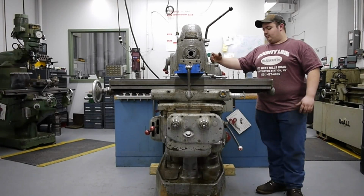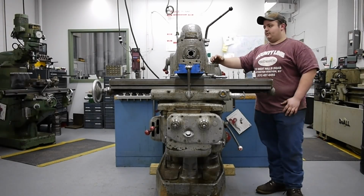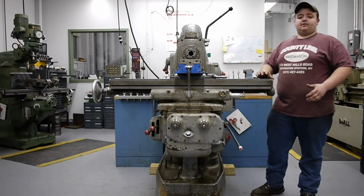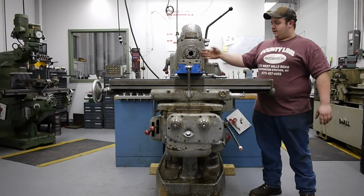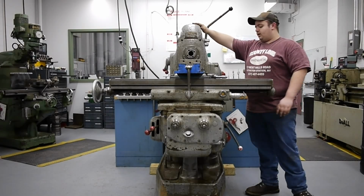And so we have that on campus, and roughly 1.5 to 2 gallons later, I filled everything back up in the machine and got oil flowing back into it. From there, on all of the column surfaces and way surfaces, I took a 2000 grit oil stone and stoned all of the light surface rust off of those surfaces, and that revealed a really nice hand scrape finish everywhere on the machine, including up on the tower, just above the column where the ram rides.